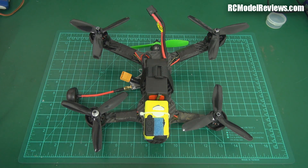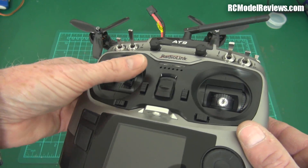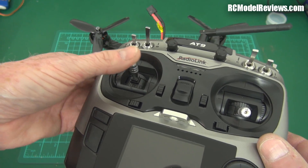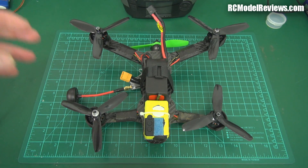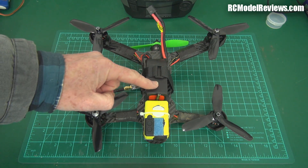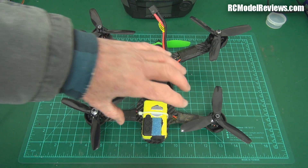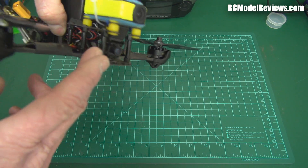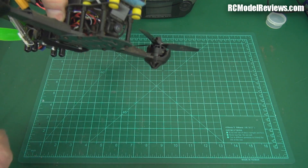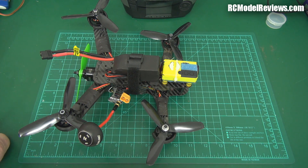I'm going to rebuild the Foxtech Screamer the way I would have built it in the first place. I will probably ditch the AT9 transmitter because even with a wider deadband on the yaw, it's just not really up to scratch. So I'm going to put a FrSky receiver in here and run it on FrSky. I'm going to remount this video transmitter in the right place and completely redesign the whole camera setup. I'll probably toss that camera out — it's small, fine, but it doesn't work. I'm going to put in a decent CCD camera and see if we can make this really work as well as it should have out of the box.